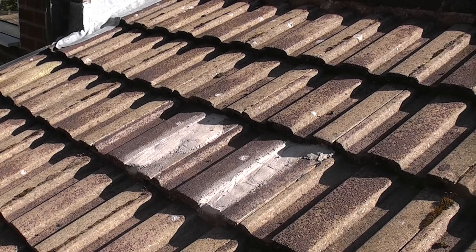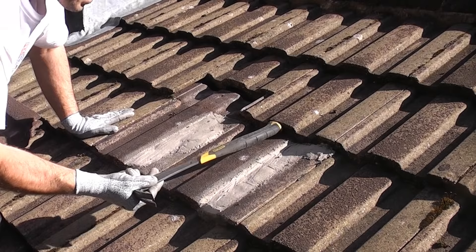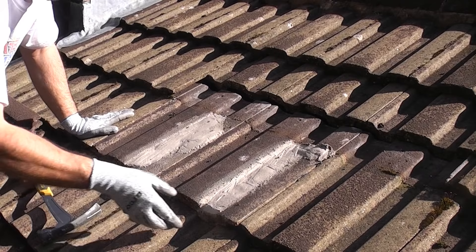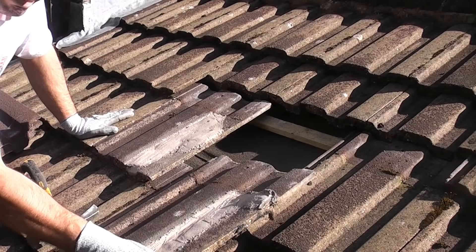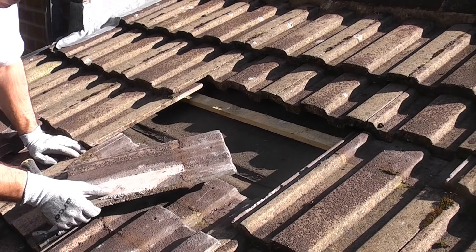These are the two broken tiles — they've been patched up recently using mortar reinforced with fibre and SBR. We're going to take the hammer and use the rubber part to push the tile above back, past the tile that you need to remove. You may find that you need to remove an extra tile as well because these tiles are interlocking. Once you've pushed back the tiles you can then lift one up and carefully lift it from underneath the other. It is very easy removing the tiles — it's simply a case of unhooking them from the slate batten, providing they are not nailed.